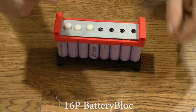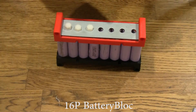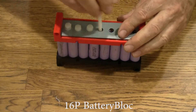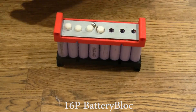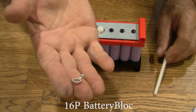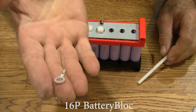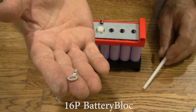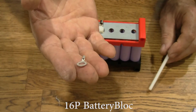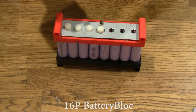All the battery blocks come with ring terminals — this is 12 to 14 gauge. You get enough to assemble your battery with. They also come with smaller ring terminals. These are the power terminals; they hold 10 to 12 gauge wire. The smaller ones hold 14 to 16 gauge wire for the BMS, sensor wires, or the hobby charger.